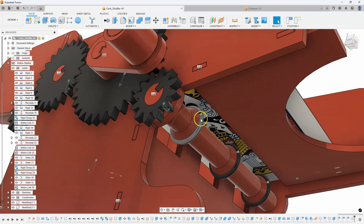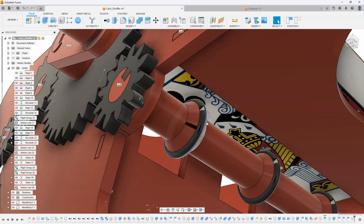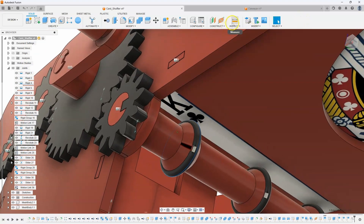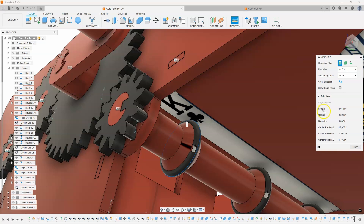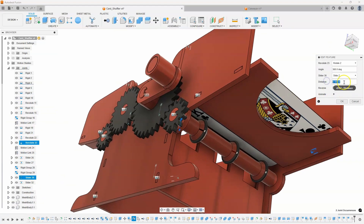Basically what I want to find out is for every revolution, how far does it need to move? You'll notice on these rubber grommets I have this imprinted edge right here. I can go ahead and measure that edge and it tells me that the total length of that edge is 2.016. It also tells me the diameter and radius, but the length is what's important. You'll notice when I hover over that number it says click to copy into the clipboard, so I'm just going to click and then hit close.